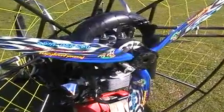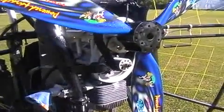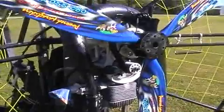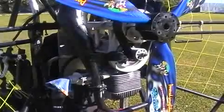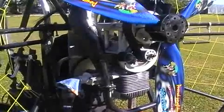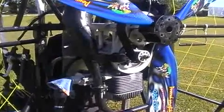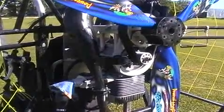Okay, as far as bolting your propeller directly to the engine is concerned, you'll notice that the propeller is not bolted directly to the crank, which is coming out over here. The reason being that you don't bolt it on directly onto the crank is that the propeller will, in most instances, be spinning too fast. So in other words, if your engine is spinning at, say, 7,000 or 10,000 or 14,000 RPM, within reason, that's what your propeller is going to do. It's going to make the prop very inefficient, and the tips will end up breaking the sound barrier. So apart from being very noisy, it becomes very inefficient.